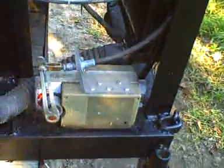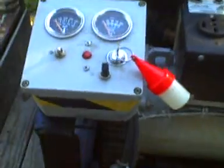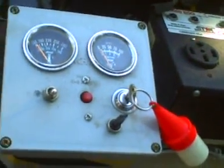The throttle control is still manual, done remotely with a 0 to 10 volt actuator which is being powered by 12 volts. That's remotely controlled via the overly simplistic control panel — just engine temp, oil pressure, start-stop, and throttle, obviously with a circuit breaker. And an external regulated alternator, just keeping things charged.